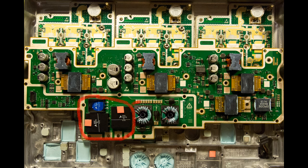Up on the right side we have a planar transformer with some output capacitors and an output choke, and this goes on for all three power supplies. The planar transformers consist of about 10 layers of PCB wherein the tracks of the PCBs form the coil of the transformer.